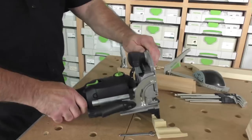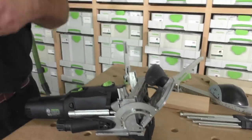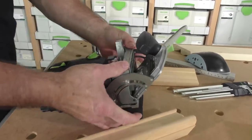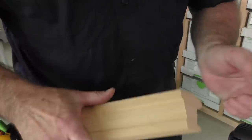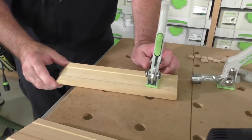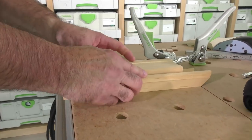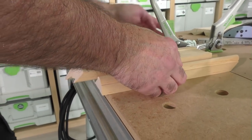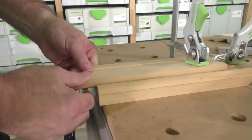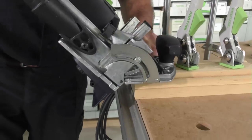I have it set at 20. I'm going to set and bottom out my bevel at 45 — so I'm going to take it at 45 and verify that. 45 to 45 — I'm good to go. I'm going to take it and bottom it out because I want to put my domino at the very top. Here's the other really cool tip: because I'm working from the back here, this is tilted. What I like to do is take the same piece of molding and lock it in so I'm above the table, going more at a 90 in here. I get that other clamp in there, making sure it doesn't impede my plate, and I verify just like this. Good — I'm ready to go.